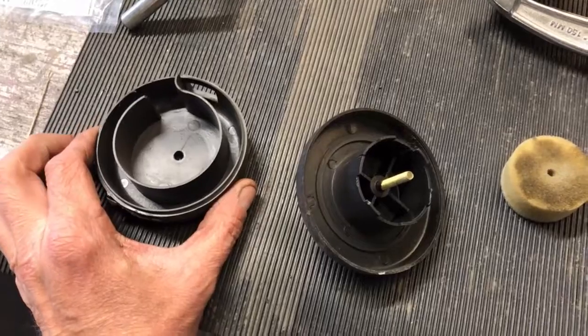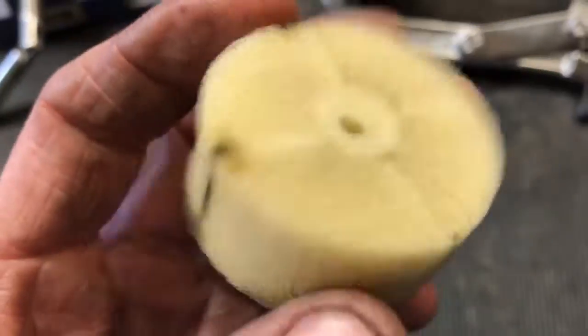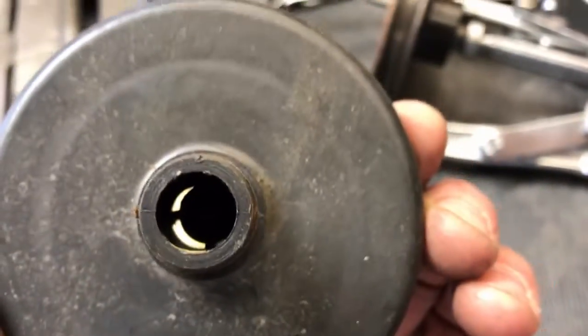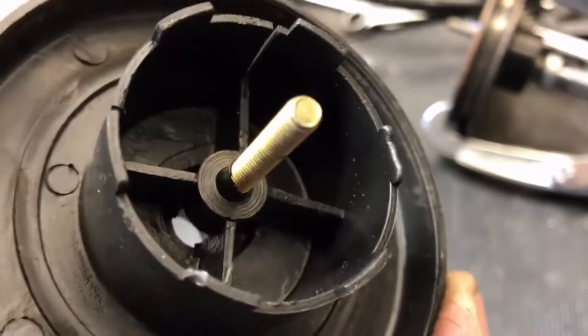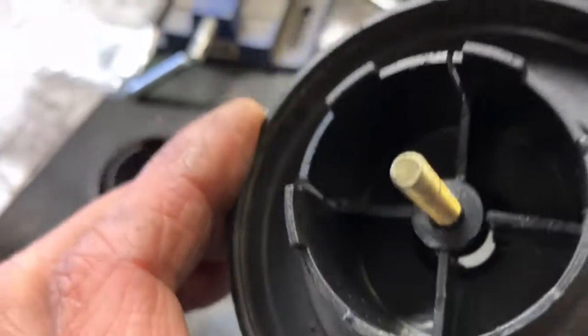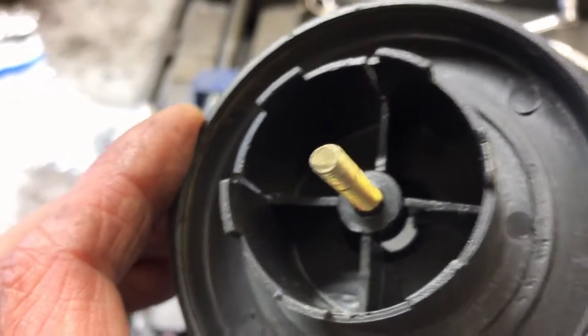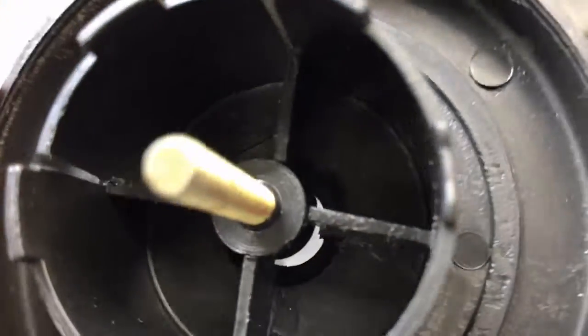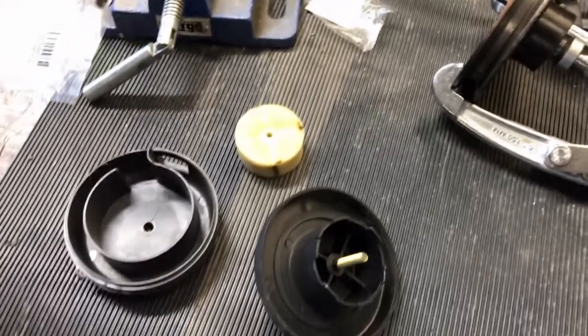Here's the air filter that was on there. I can tell you right now, by the amount of suction I felt on that intake, that this was in itself inhibiting the performance of the air compressor. There's one thing we've got to remember about intake systems: anytime you have vacuum involved, the maximum air pressure you're going to get from an intake system without forced air is 14.5 PSI — and that's only if you've got 100% vacuum behind the intake. So anything we can do to improve the intake size and geometry is going to improve the performance of that pump.